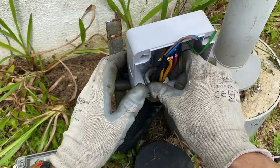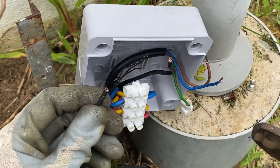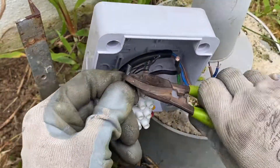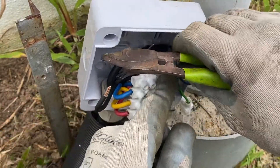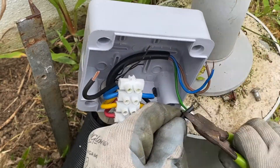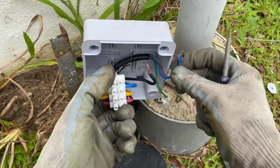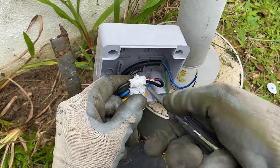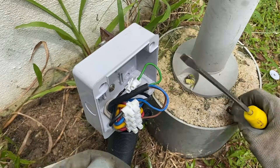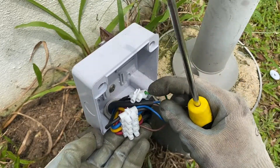Next I'm going to connect the wire — it's color-coded: red to red, yellow to yellow, blue to blue. The last one is neutral. This is a 20amp outdoor connector, meant to withstand high temperatures so it won't become brittle and should last longer. Then I'm going to connect the wiring for the pedestrian lamp: blue goes to the black wire and brown goes to any one of the red wires — it's three-phase wiring.